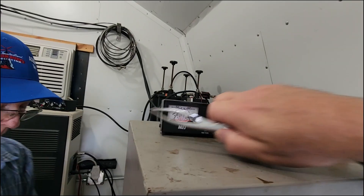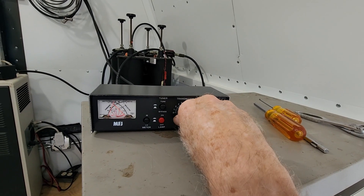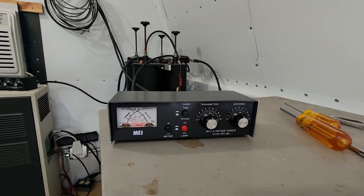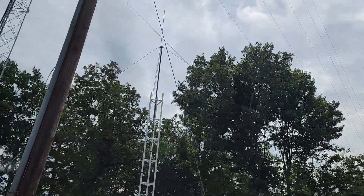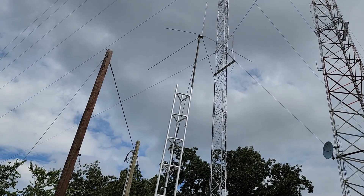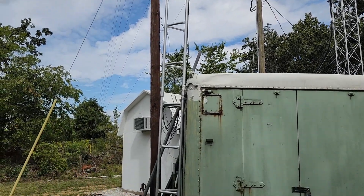Those cans are so tall compared to two-meter and 70-centimeter duplexers because the wavelength is longer. Don also has a tuner, and he thought that if the SWR on the antenna and coax wasn't as low as possible, we could use it — and sure enough, you can see the needles move. We can see the output power and tune the antenna down to a 1:1 SWR, adjusting the transmitter side to get maximum power out. Folks, if you're not part of a club, get involved. There are so many activities — we're just temporarily putting up the six-meter repeater antenna and starting to use six meters more prominently. These repeaters need maintenance throughout the year. For the Lake Cumberland Amateur Radio Association, I'm KY4BDP Bryan. Hope you enjoyed the video. 73.